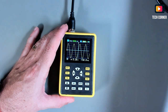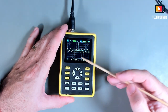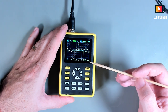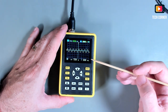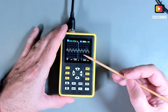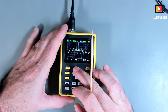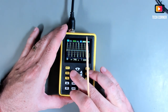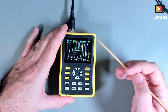And let's move this to 100 megahertz. It's the maximum of my Owon XDG2100 function generator. And with this bandwidth, the VPP is automatically adjusted to 2.5 volts. Okay, let me just increase here the amplitude to the maximum. Yeah, it's also 6 nanoseconds.